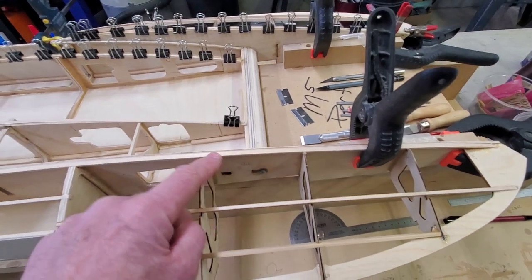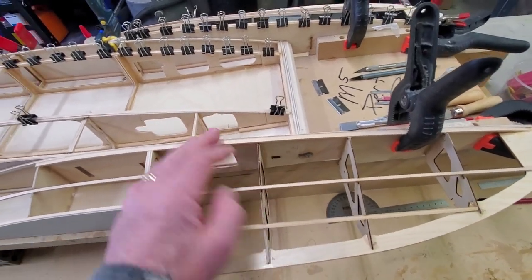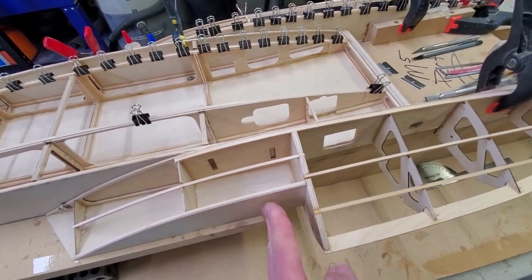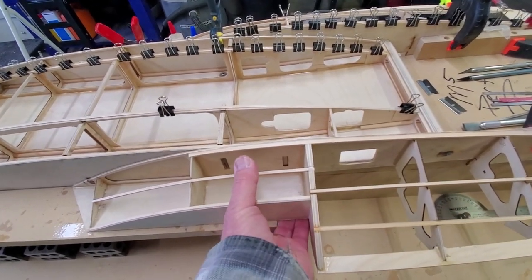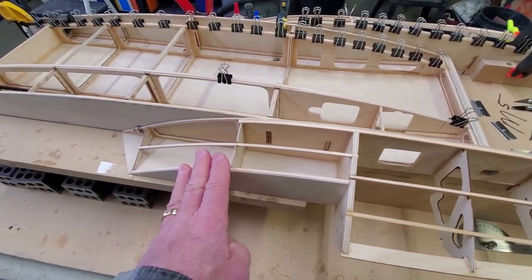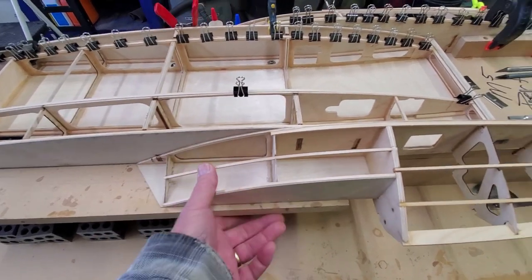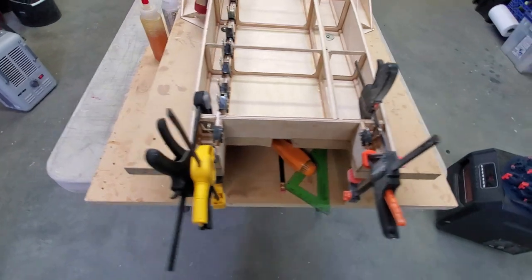Have them land there. I've laid this one down with the three-sixteenths up top just because I want a whole lot of glue surface up here to keep the deck from popping free. Add a stringer here — it's absolutely critical because of the turn fins right here. The weight balance of the boat is going to be in line with that turn fin, so anytime you pick up the boat you'll carry it right there, you'll squeeze and flex the deck, and it will crack. Continuing on down here helps keep the deck from bowing in when we go to put the skin on.